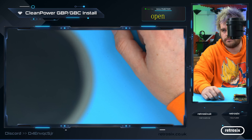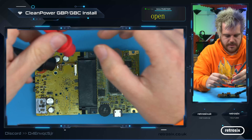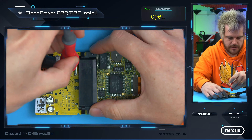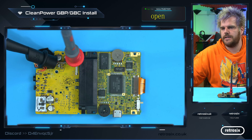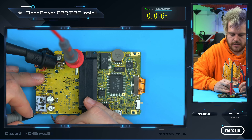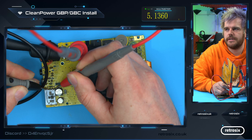Now we want to juice it up again. Let's apply the 3-volt input to the system. This time we won't have the screen working because we've disconnected the negative LCD voltage — which we don't need since we plan to upgrade with an IPS screen that doesn't require that. Connecting to the main in and connecting the power, we can do the same test again. You can hear the audio, so you know the system is working. Connecting to ground and the input — there's the 3 volts. And then ground and output — you can see a nice steady 5 volts.